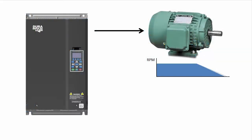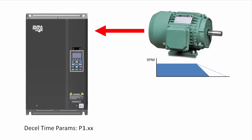If you want to decelerate a motor faster than it would normally decelerate by itself, you can set the deceleration rate in the GS4 drive. The drive absorbs the energy that the motor would normally dissipate over time. The problem is, if the load has a lot of inertia, the drive electronics may not be able to handle dissipating all of that stored energy because the motor is now acting like a generator and trying to push additional voltage back into the drive, which causes the internal DC bus voltage to rise, causing an over voltage fault.